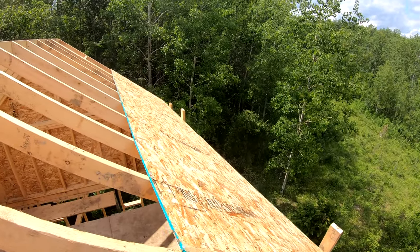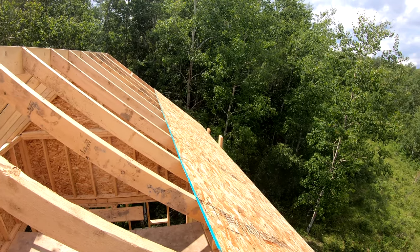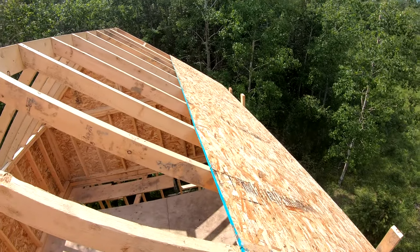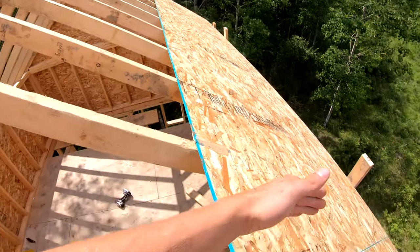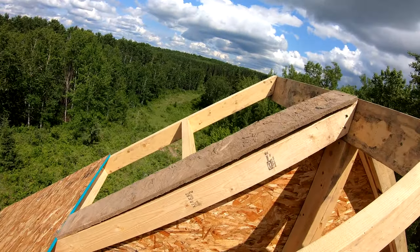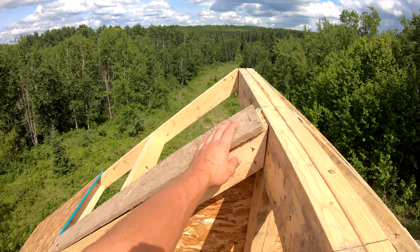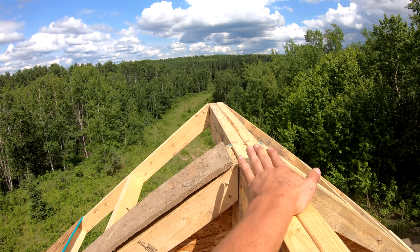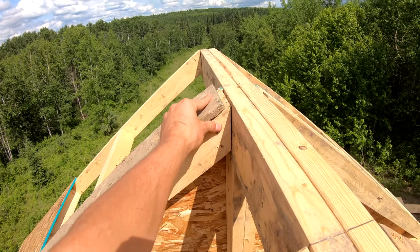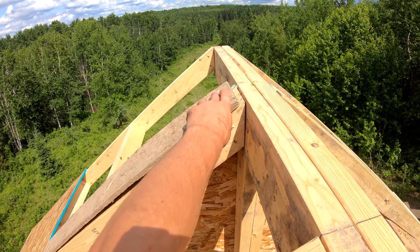Got my first layer down and tacked down pretty good. I've put little nails on every rafter, which will give you the one-eighth inch you need here for heat expansion. I'm just determining my height and how I'm going to overlap the panels now. I cut this one to 43 and one-eighth just to mock it up. Because of the double ridge board, you can't lay plywood right to the top — I have to cap that off with your shingles. So I'm going to go 43 inches on that — you don't want it higher than your ridge board. Should look pretty deadly.